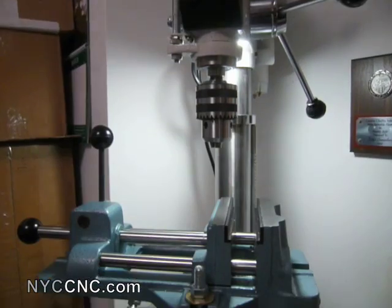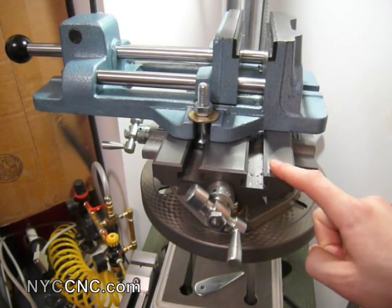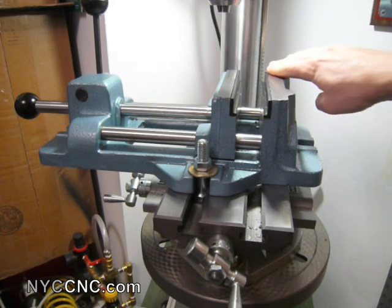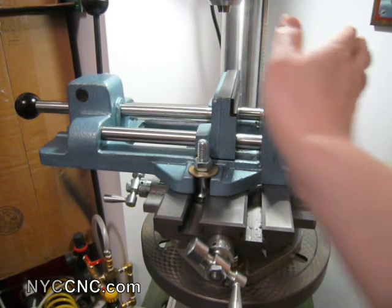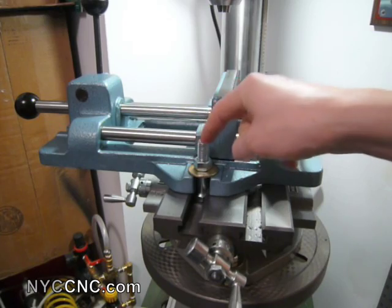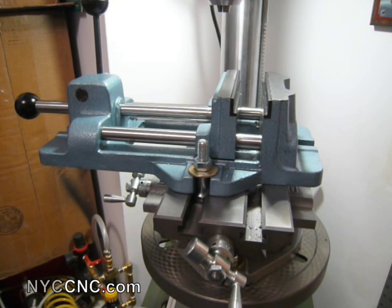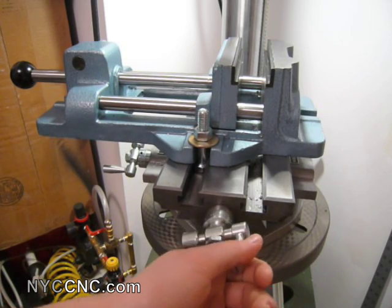As you can see, we're standing in front of the drill and I've got an XY table — the gray piece — and I've actually got it mounted sideways. I did that because the vise I have is a six-inch Wilton Camlock vise, and frankly it's just too big for this size drill press. If I had rotated the vise the other way, I'd lose workspace, and it's difficult to bolt the vise down with the T-slots perpendicular. So the best solution is to have the XY table mounted 90 degrees to what it normally would be.